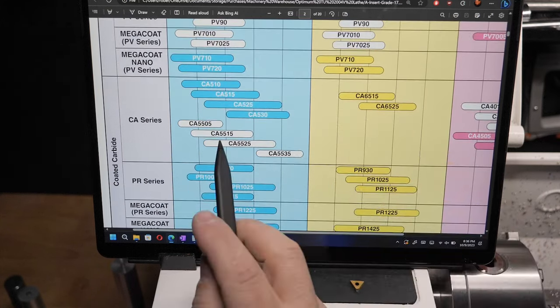right here. What I did before I started this was I took this back to my aluminium oxide wheel and I gave it another tip. This time I put more of a cutaway there on the top. I gave it a nice smooth round edge there. And I finished it up with my little sharpening stone and I used that.